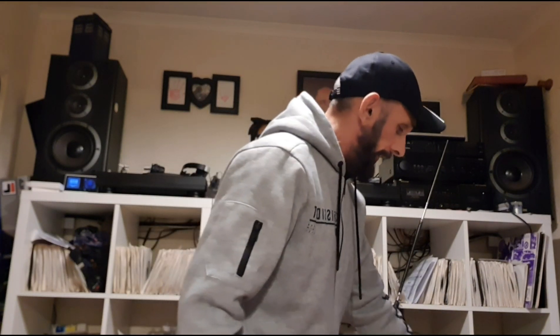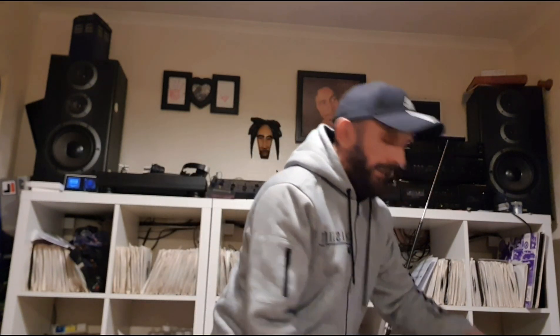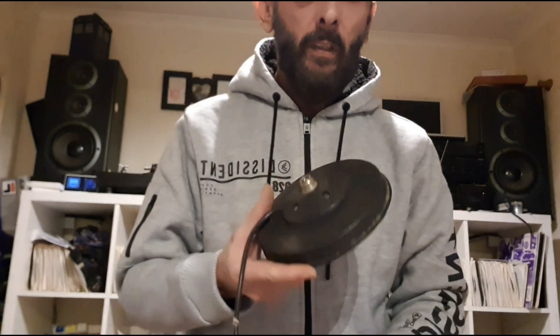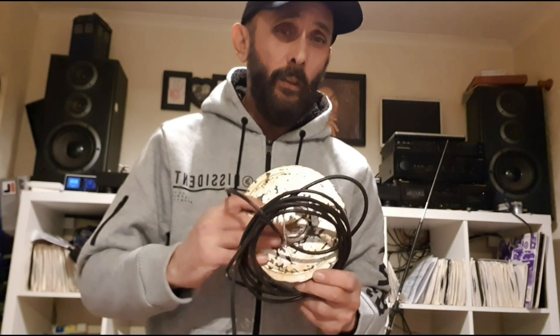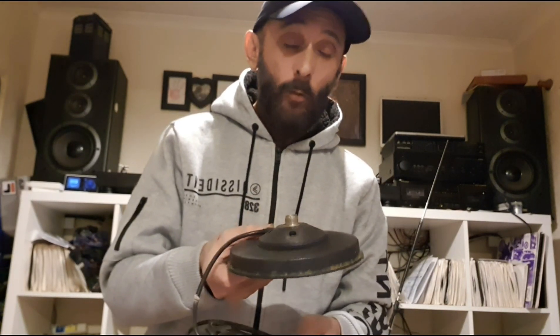So right now I'm going to plug my FT817 in and I'm just going to use a mag mount — just to see what we can receive. I don't recommend mag mounts other than for two meters, 70 centimeters, that kind of thing. They're not very good for HF; they don't get a particularly good ground connection. So this is just good for playing around, doing little portable demonstrations, things like that. I'll set my antenna up and you can see what it sounds like.